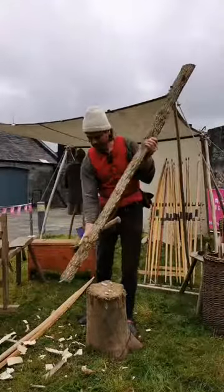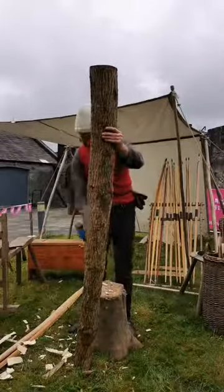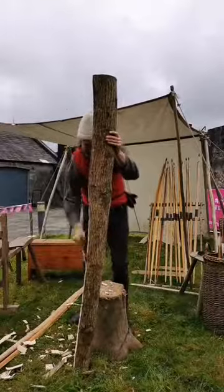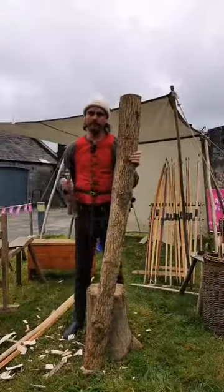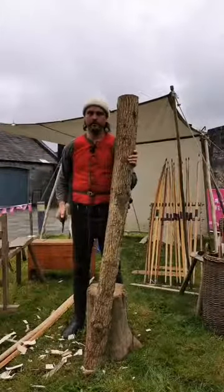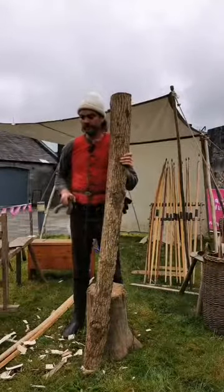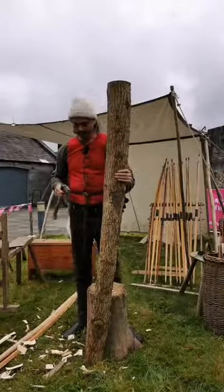We could do two hours of axe work if you like — I get well into this and get really mesmerized by just doing it. But you can see the idea: it's quick stock removal to get the shape you want. In modern day we might use machine tools like in a woodworking shop, but historically that wasn't available. Before the advent of water-powered mills, you could definitely be using a hand-forged side axe like that. This is ash; other timbers I would use include yew wood, of course, which is the most famous and best wood for making longbows in a European historical context.